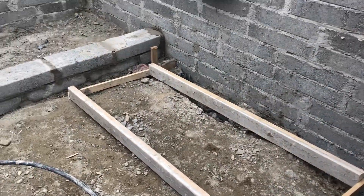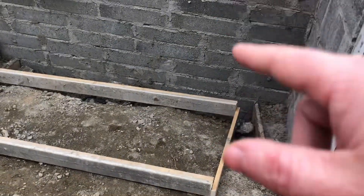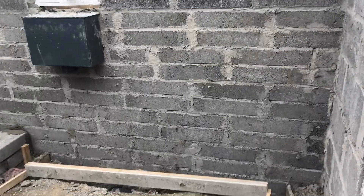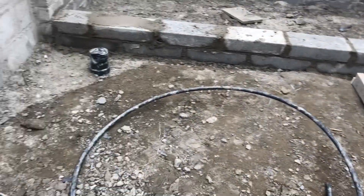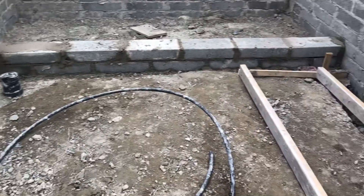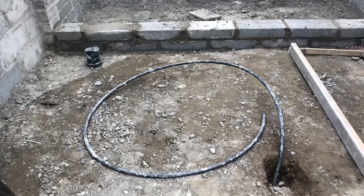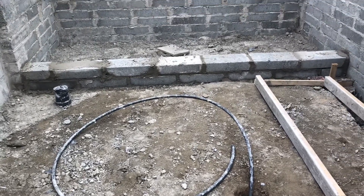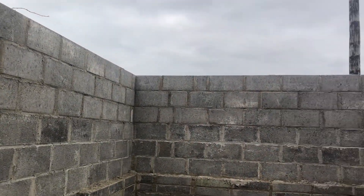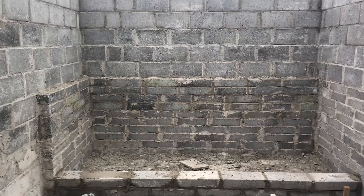So there are three waste routes going in: overflow for this pond, overflow for other points, and also waste from the drum going down there. I have to dig this bit of ground up - take about two inches off to get the right level for the combi drum, then just about two inches of concrete in here for some sort of floor, plus some leveling concrete after that to get a level. The next step after that will be the roof - a flat roof with a bit of a tilt so rain comes off.